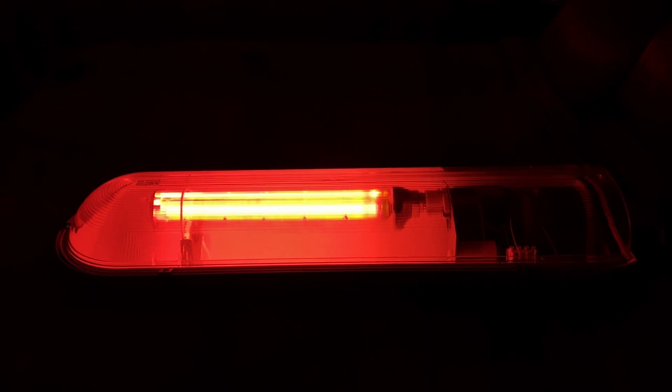Now I think it's time to run up and switch on the lantern. There's the blue — or kind of bluish — flare coming from it. I'm going to turn off the exposure just a little bit and let that warm up. I'll speed up the video so you can see the warm-up process more distinctively. On camera it appears more red, but in person it's more pink — kind of pinkish-reddish — due to the neon and argon, or penning mixture, that's currently being struck.